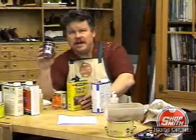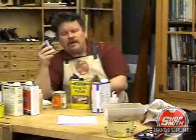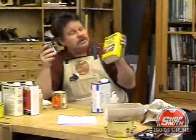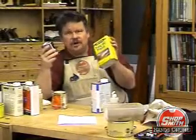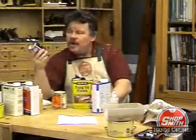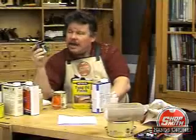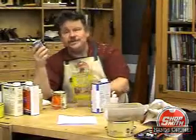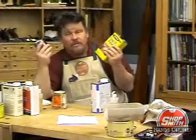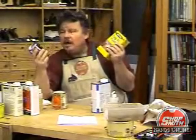But what happens here is, at that point, you have these fairly soft resins, alkyds they're called, and they look beautiful, but they're not very durable. Here, you have a much tougher resin, phenolic or plastic, and this adds some toughness, and you get a much more durable finish. Also, a finish that will build to a high gloss much faster.